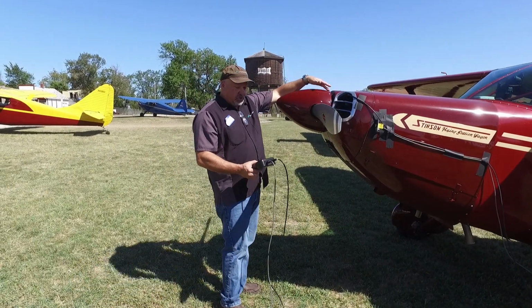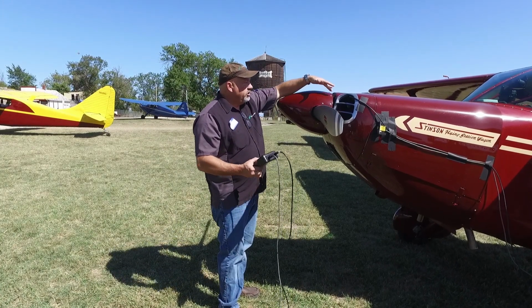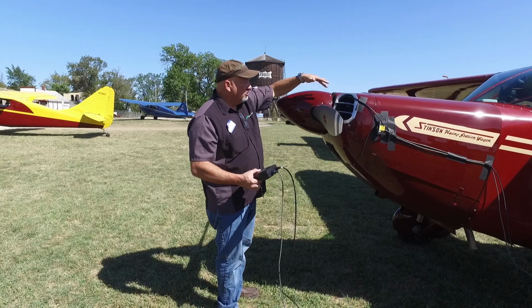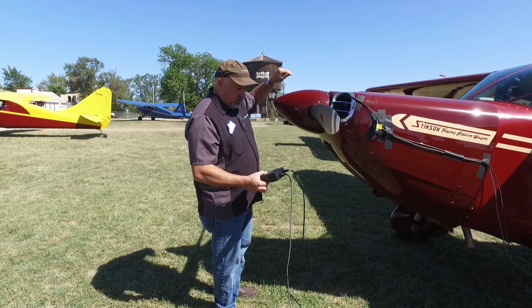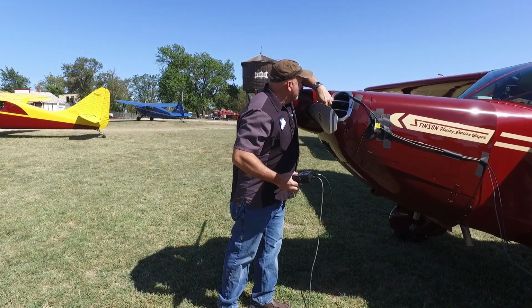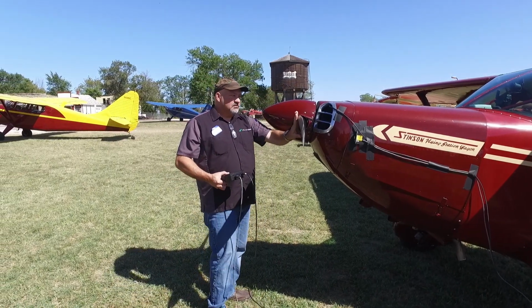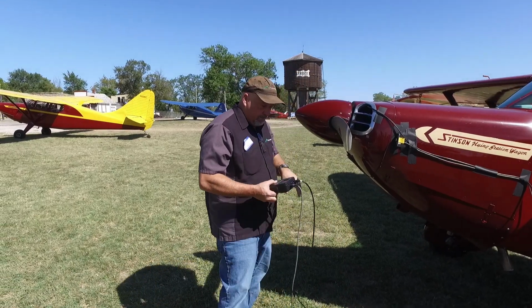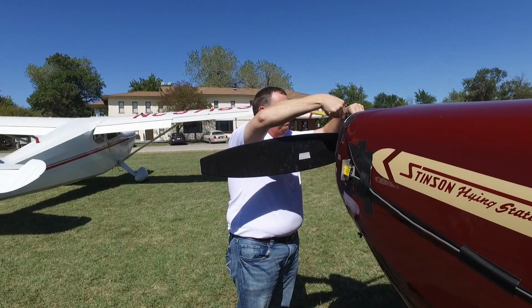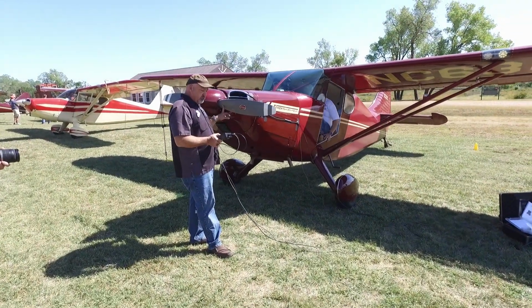So this is position 1, and even though it's rotating counterclockwise, the numbering on the DynaVibe GX is actually in the direction of clockwise. So it's saying to add the weight to bolt 4, which would be right here. So it's indicating that this blade is light, and what we're going to do is add weight to the nearest location. The weight at position 4, I was asking for 24 grams.